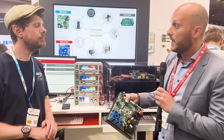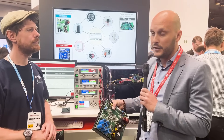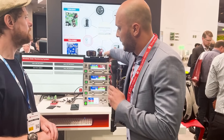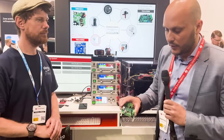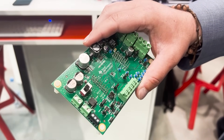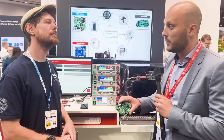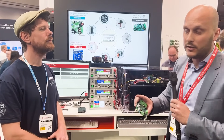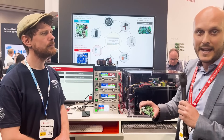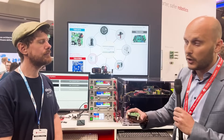That's only one part of the entire system. Moving to the position sensing of the device to control the valve, we're using some of our stepper devices and BLDC devices. The innovation here is we're also using a 3D position sensor, which detects the position of your damper or valve. If your valve is stuck or your damper is stuck, you're going to detect that — so you know you're not pumping too much air or water in your system and wasting energy.